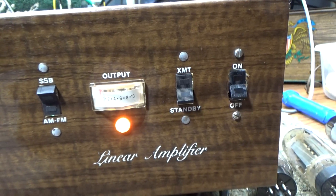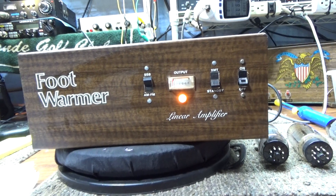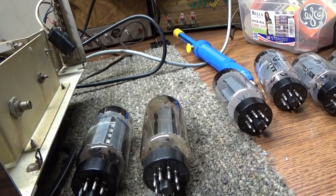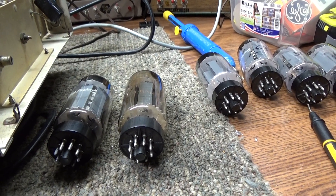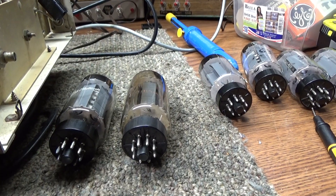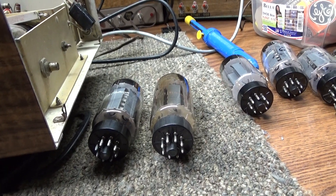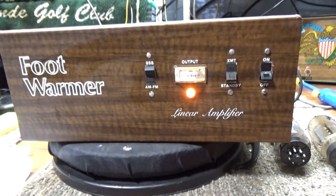So that's going to be it for this one. The 8908s are almost unobtainium, but 6LW6s and the higher filament versions can be found relatively cheap for the biggest sweep tube made - the M2057, aka the 8908, aka the 6LW6 with a different pinout. Again, the 6LW6 cannot be used in a grounded grid amp like the Golden Falcon which uses 8908s in grounded grid. Unless you address that and convert it to a grid-driven amplifier - which would be a lot of work and modifying - the 6LW6 won't work in that. Alright, that's it for this one, bye.